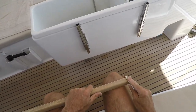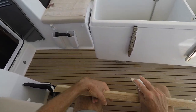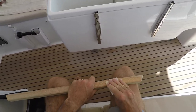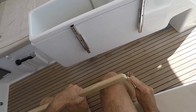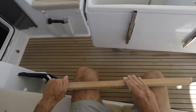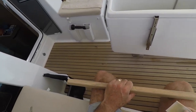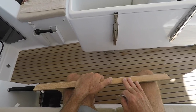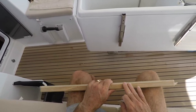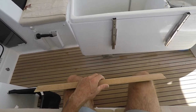This piece was fortunately in pretty good shape. On bigger pieces you could use a palm sander or an orbital sander. Try to go in line with the grain — like any sanding, you want to go in line with the grain. Get the edges a little bit too. I'm not going to worry about the bottom side because nobody will see that. A palm sander would work great, and you can get some of the grayness out. If the gray is really deep, you definitely want to use a palm sander or even a teak cleaner.